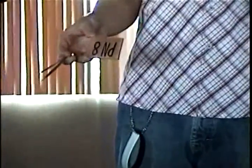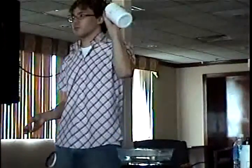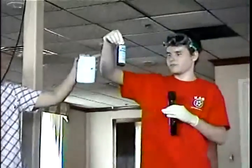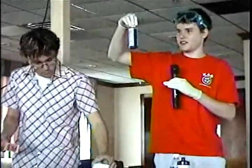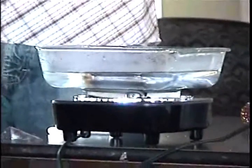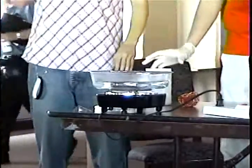There are two different kinds of etchant. One is ammonium persulfate — you can get it online, it's safer, and it's clear, which is nice. The other type is ferric chloride — it's dark brown. You can't touch anything with it; it'll stain concrete, it'll stain a stainless steel sink, it will stain anything. So don't use it, use the other one. Keeping it hot will help, and if you really want to get slick with it, you can get a bubbler — like a fish tank bubbler — that will create bubbles around it, which will help speed up the reaction.